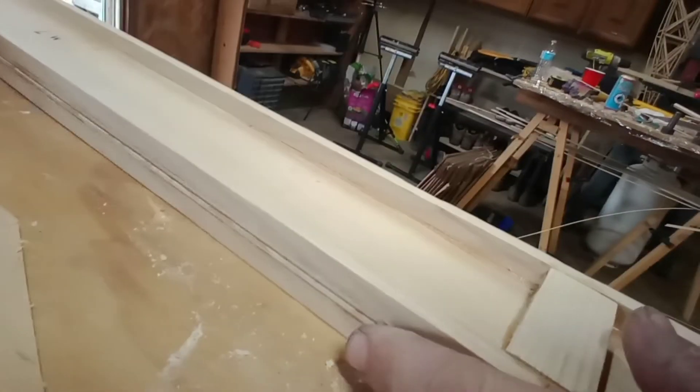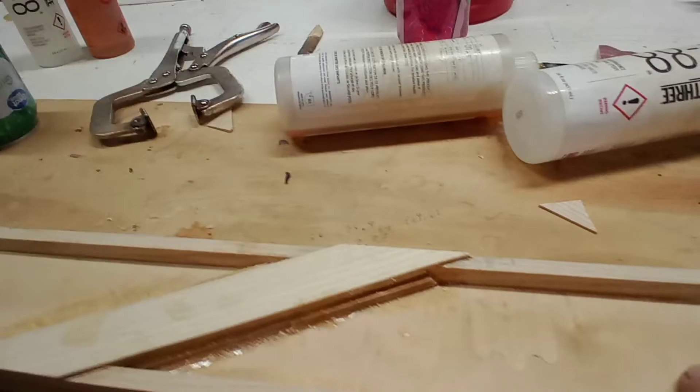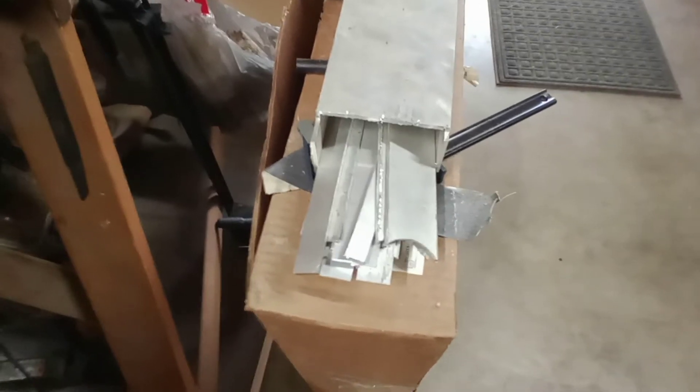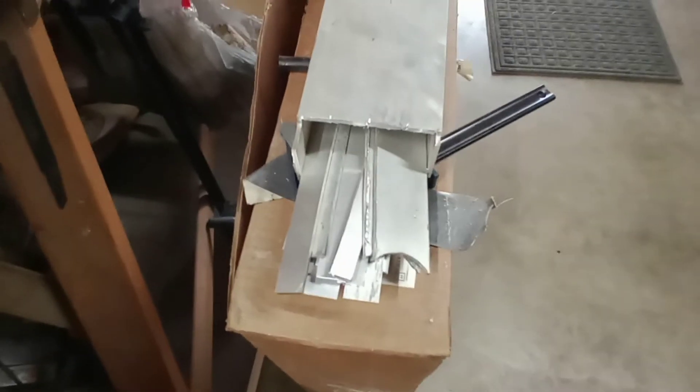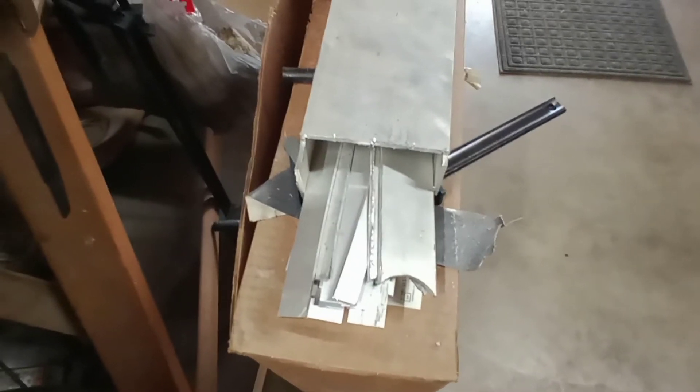Now I've stacked them up bottom to bottom, back to back, and I'm getting ready to drill all the positions that need holes — just like I did with the main spars. But before I can do that, I have to make the brackets. I sawed them all off with the bandsaw at work just to speed that up, then I'll round one end and drill all the holes.